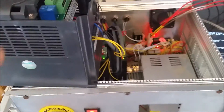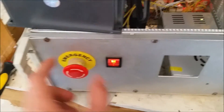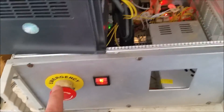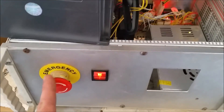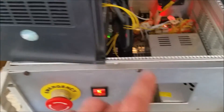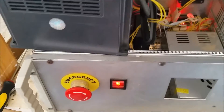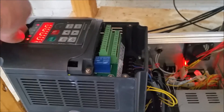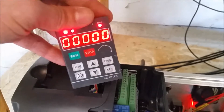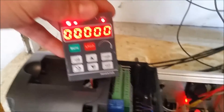It's all pretty bulky right now, but I did find that this VFD will drop right inside this case. The only thing stopping me is the emergency button here. If I make a new faceplate — which I happen to have a CNC machine to do — and move this switch and button over to the other side above the power supply, the VFD will drop right in. I'll mount the screen it comes with on the front so I can control it similarly to how the old VFD was.